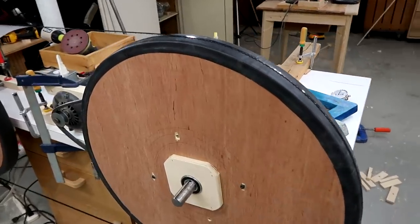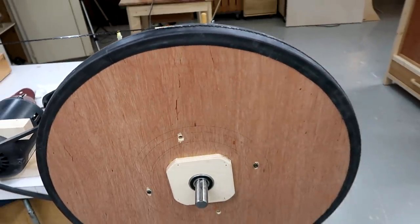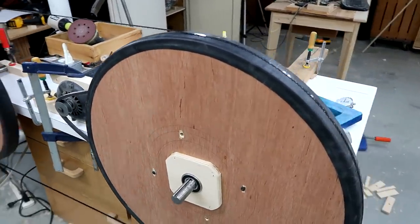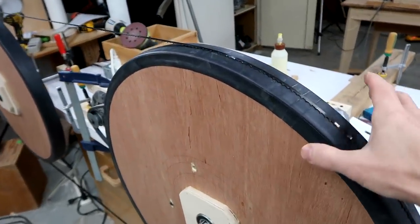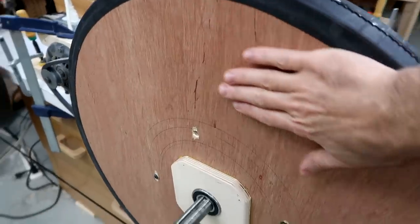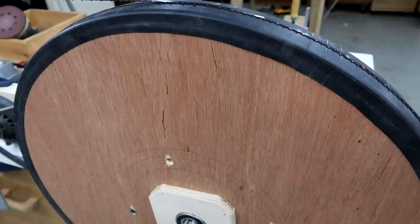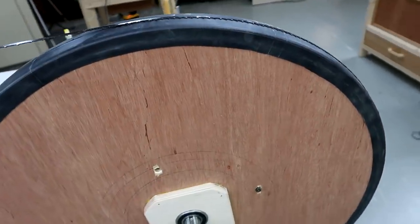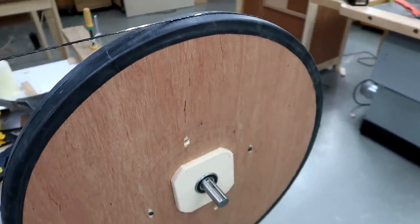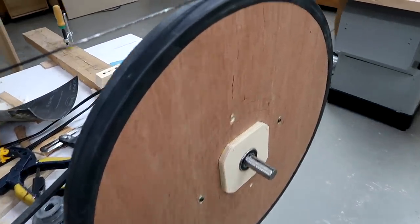It's been suggested I could just make this out of solid plywood and cut holes into it to make spokes, which would also make it lighter and be much easier. Some years ago Marius Hornberger built a bandsaw with wheels out of MDF and cut a lot of holes to make it lighter. But I want the wheels to have a smooth surface, because any holes cause dust to really build up, and any spokes or holes make the wheel more of a fan, whirling dust around — that's another thing I don't want.